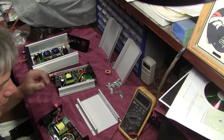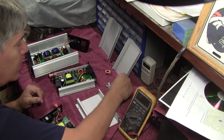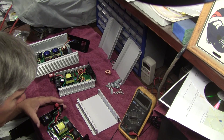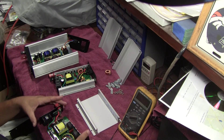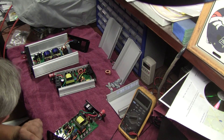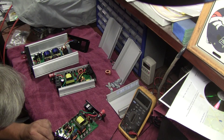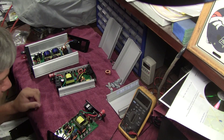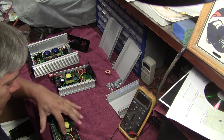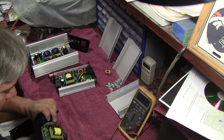Here's all the hardware gathered neatly. This one was the one that had the open AC. The first thing we're going to look at is that fuse right there — that round PC board-mounted fuse. 10 bucks says it's blown.